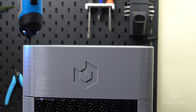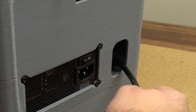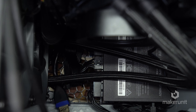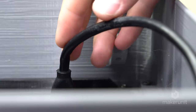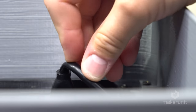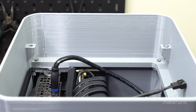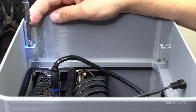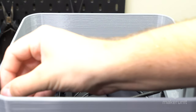You may wonder how we're gonna plug in the display cables if the graphics card is mounted vertically inside the case. It's actually quite simple — there's a big hole in the back of the case where you insert a cable at an angle, leading into the bottom of the case, where you can stick your hand down and pull up the cable to plug it in. I wanted the top part of the case to be easily removable using magnets, but flat head wood screws worked just as well for the lower part. The magnets stick to the head of the metal screws, and using screws instead of magnets lets you manually adjust the fan height to compensate for different fan thicknesses.